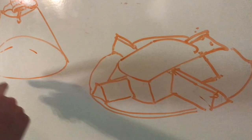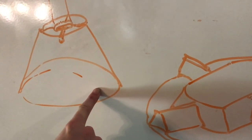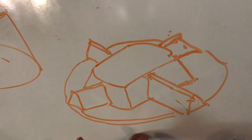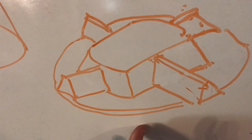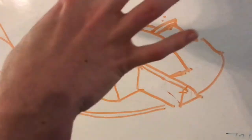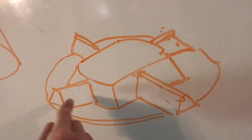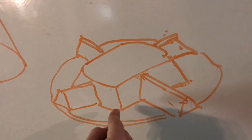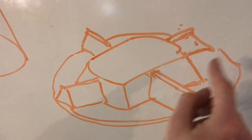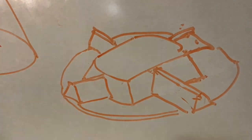This is the rough idea of the pillar thing that we're going to be trying to mold. This is a rough drawing of the insert I want to put in the bottom of the flower pot. As we pour the concrete around this, we'll end up with a little indent that's just the size of our posts, and we've got these little chamfers that will allow water to drain out so it doesn't sit on the wood and rot.